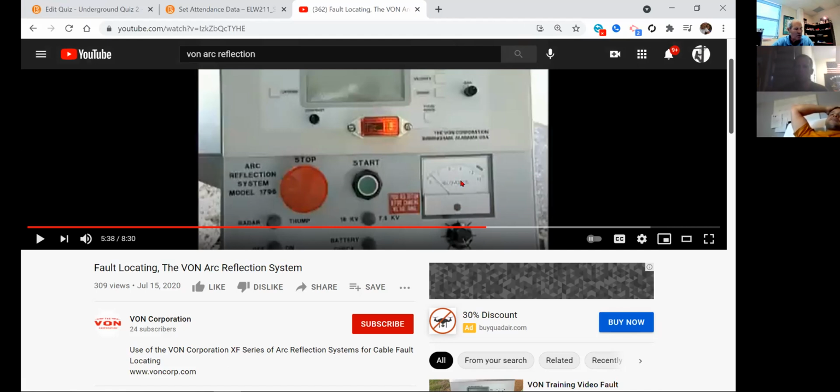You cannot adjust, and it's in this red sign right here, you cannot adjust the voltage while it is running. Do not press start and then adjust the voltage knob down here. It'll destroy the capacitors that are in the machine. If you press start and it goes down to 5,000 volts, press stop. Move the knob a little bit. Press start, goes up to 7,000, still not high enough, press stop. Move the knob a little bit more, press start, then you're at your voltage. Spelled out specifically right here.